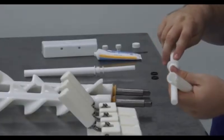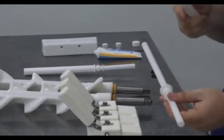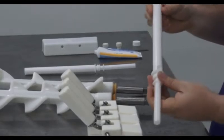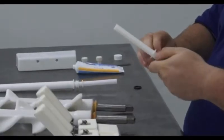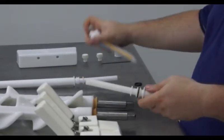When reassembling the gravity tube, there are 3 filling choices for overrun on each pipe. These are selected by placing the outer sleeve over the inner sleeve and turning the outer sleeve to the desired hole. It is important that you select the correct hole for your desired product. The O-ring is returned to the bottom and only the exterior portion is lubricated. The process is repeated for the other tube.